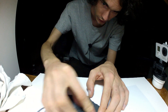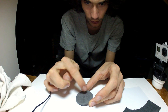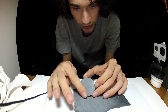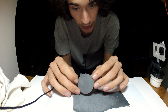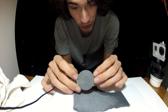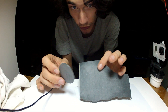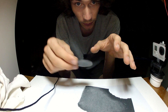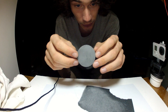Keep in mind that this stuff sands really quickly. It's got a lot more to go, so I'll be right back. Alright, we're done with the 180 and you can notice that the back is looking pretty good — it's taken on a whitish tone. There are some metal particles starting to show. Also, this material will load your sandpaper up very quickly, so make sure you move around a lot to make sure you're actually cutting and not just sitting in one spot. Check it occasionally to make sure you're not going to sand your model down too much.